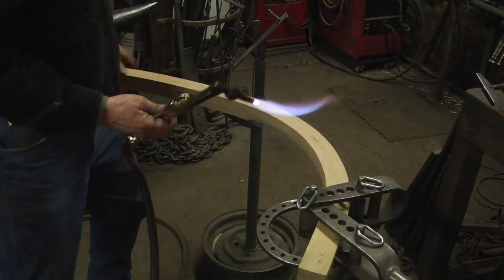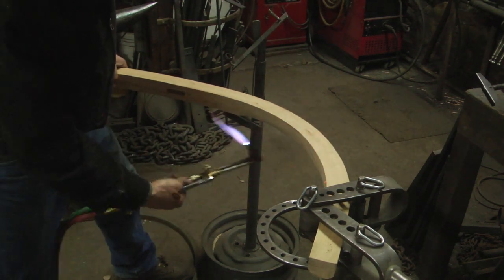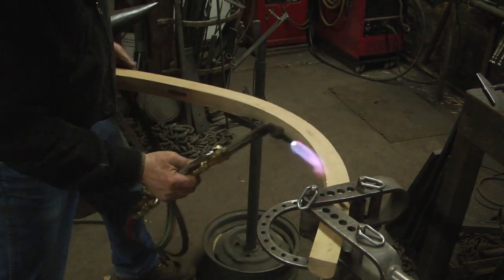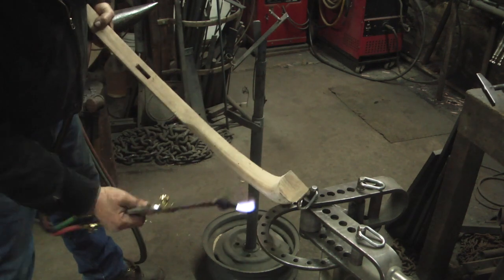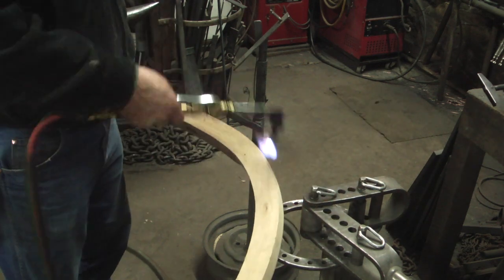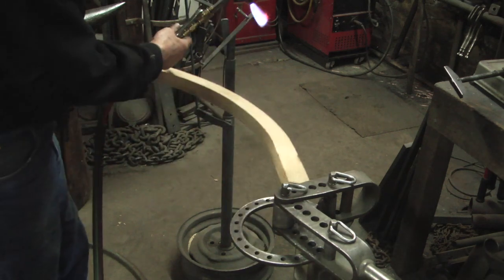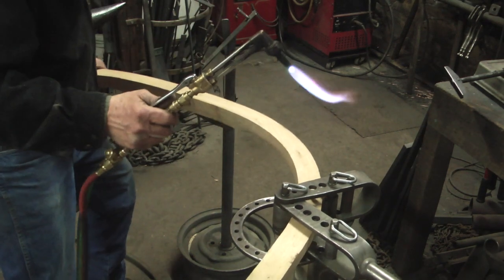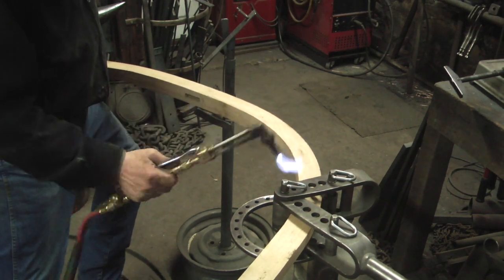This is also a piece of hickory — an inch and five-eighths thick by two inches deep. I'm going to concentrate with a soft flame most of the heat to the inside of the arch of this pole circle. If you remember, bending wood involves compressing the fibers on the inside arch. So by using the moisture that's already there, adding heat, and then enough pressure, I can cause those inside fibers to relax enough to open this up and make it usable.